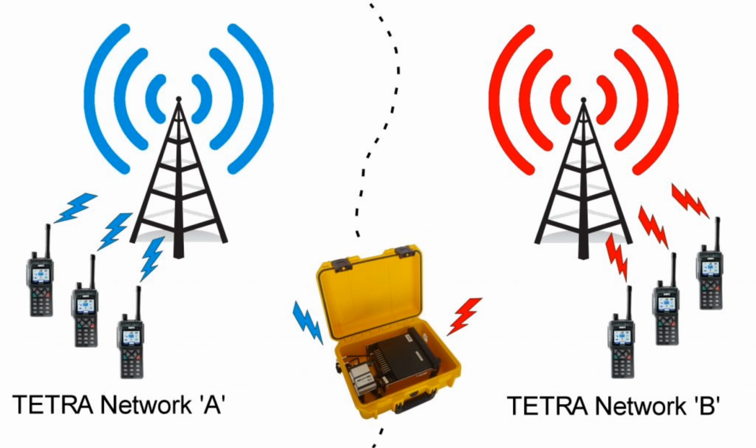It lists common alarms too, things like receiver synthesizer lock failures, different DC voltage problems, even issues with its internal clock reference. How do you diagnose something like a site link fault if it loses connection to the main network? Well, the basics first, like using ping commands just to see if the IP connection's even there. Then there are more specific checks.